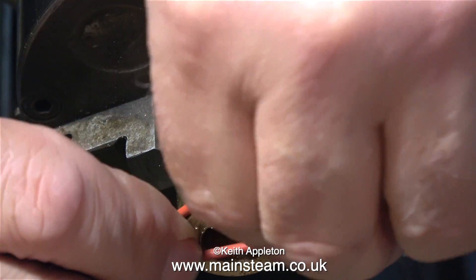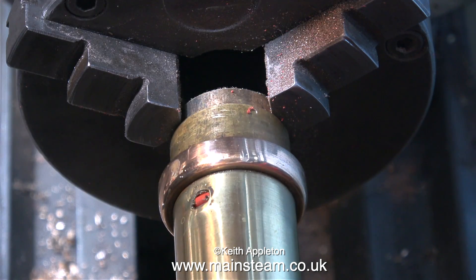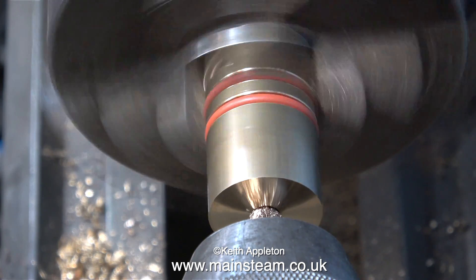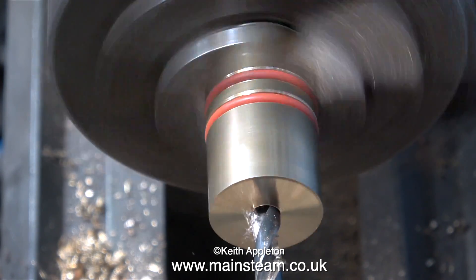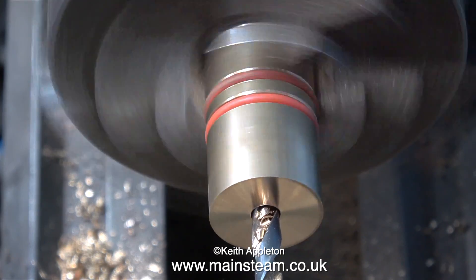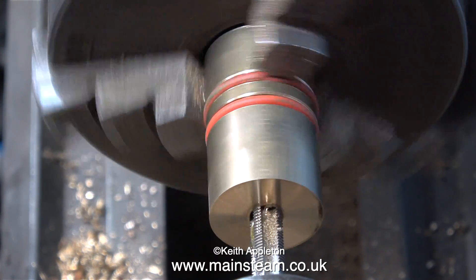Here I'm fitting the second O-ring. If this was a piston I wouldn't do it this way — I would clean up the part before fitting the O-ring — but this is a very simple part that's just going to fit inside the chimney. As you can see, the chimney is a good fit. I need to move it into the right position, and eventually I'll be drilling a hole in the piece of metal to take the water outlet. I'm making the bottom part of a water tank — the main water tank will be the chimney — and that's why I'm using the two O-rings to stop the water leaking out.